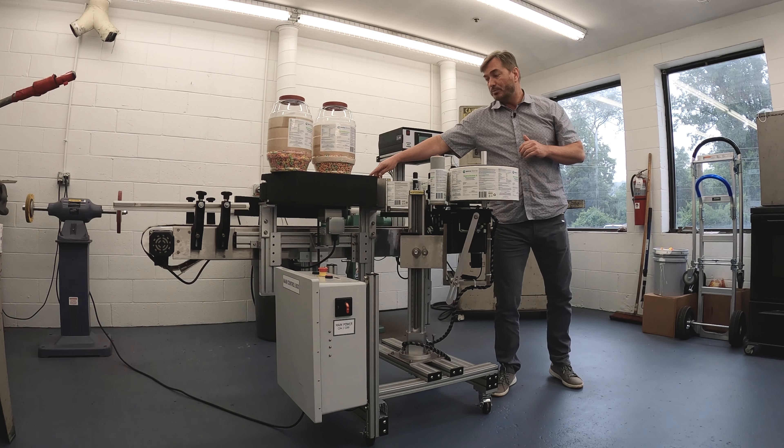The liner then comes around to the drive roller. The same motor that turns the drive roller also turns the rewind assembly. So at the end of a job, all that you're going to do is pull your pin out, take off the spent label liner, and you have a fresh roll of labels and you're ready to run.